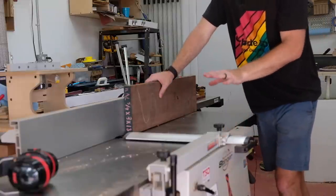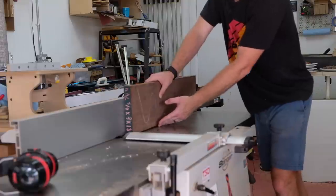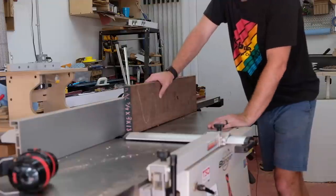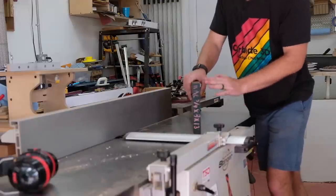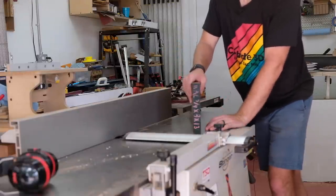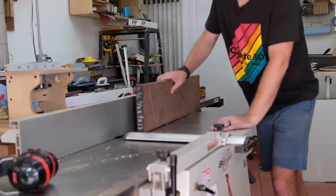So I'm over here at the jointer and I've postponed rough cutting the rest of my material because I want to make sure that I can get what I need for the outer casework before moving forward. What I'm going to do is put a clean edge on here and then rip it to rough width at the table saw so that it's less material to have to resaw. I'm only going to have to rip off about an inch or so, but that's just a little bit less material to worry about cutting at the bandsaw. I initially wanted to see if I could get my casework and my dividers from this one board, but I think it's going to be cutting it a little too close. So what I'm going to do is resaw this to three quarters of an inch thick in the rough, and whatever my offcut is will be used for my gridwork that will hold the watches in the case — just a quarter inch material that I'll need in the end. And I'll end up getting my horizontal and vertical dividers from other boards that I'll resaw later.